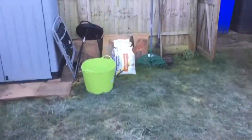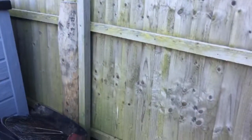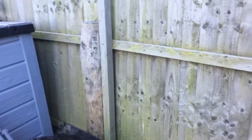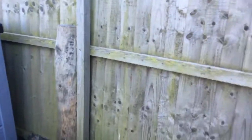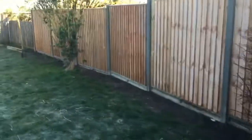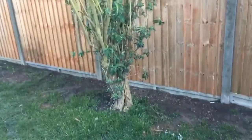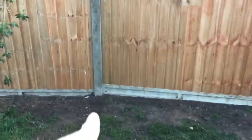This top bit up here is just going to have concrete posts with the face where you put the nut and bolt - I'll show that when we do it. It's going to be feather-edged with a wooden gravel board along there, so that's next week's job. I still haven't been to the fencing supplier, which is the problem - I need a different post to do that section.